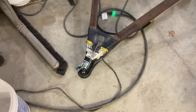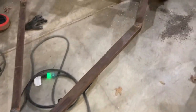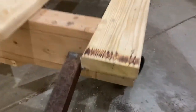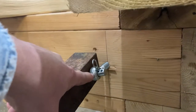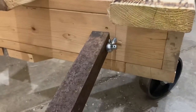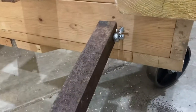I bought a two-inch coupler from Northern and welded up some angle iron I had laying around — obviously just some old rusty crud. I attached it to the cart with some eye bolt fittings and a pin with a cotter pin. What's nice about that is I can remove the trailer tongue once it's where I want it, so I'm not tripping over it sticking out.